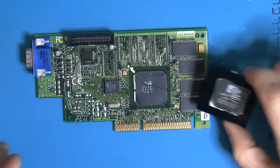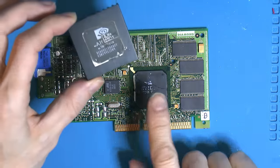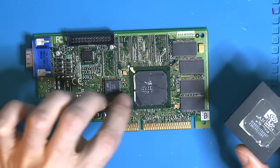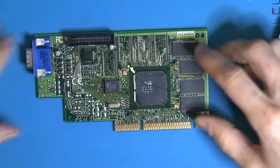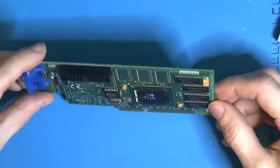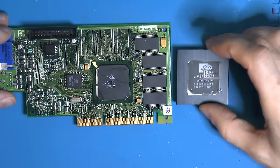So the thing is, like holding it in the heatsink and getting in between there, the force goes into the heatsink, not into the BGA balls, because then you're gonna kill the card. And you have to reball it, which I can do, but then why should I spend half a day doing that? I have tested the card, it works fine, still.